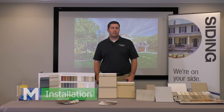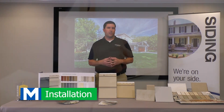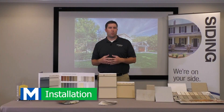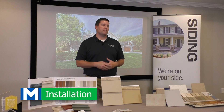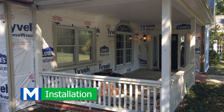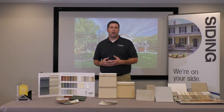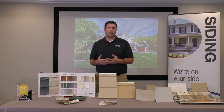The first one would be installation type. There are two common ways to install new siding. Vinyl siding can be applied over the top of your existing siding — this is not a common method that we like to use at Mosby Building Arts, but it is an industry standard in some areas. The other installation type is removing the existing siding, taking away all of that water-damaged siding, installing flashing and house wrap behind the siding, and then the new siding gets applied to the house and finished all around the windows and doors. That is the method that we commonly like to use.